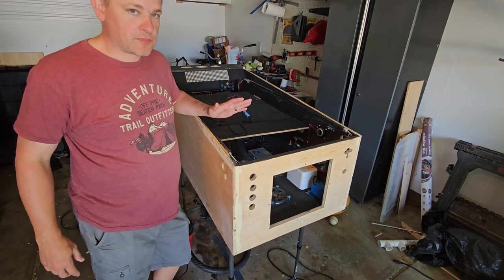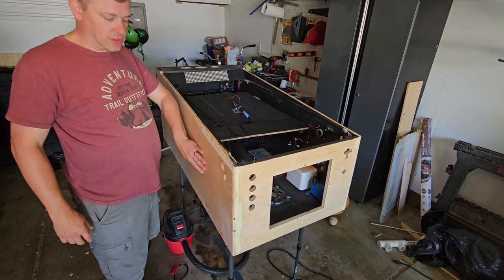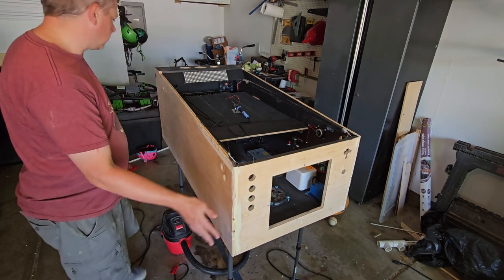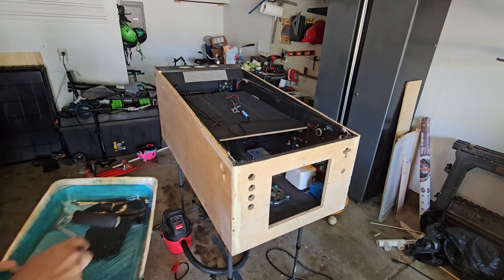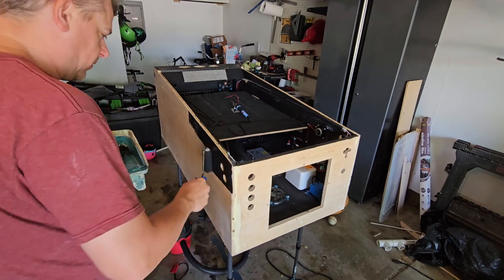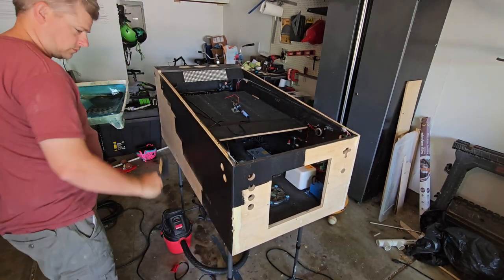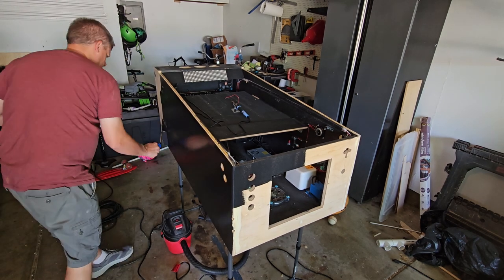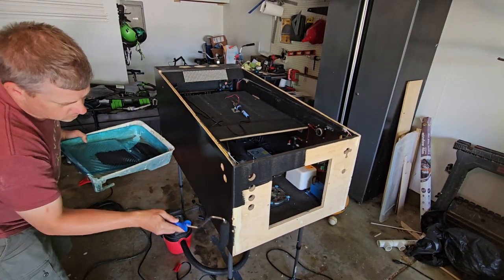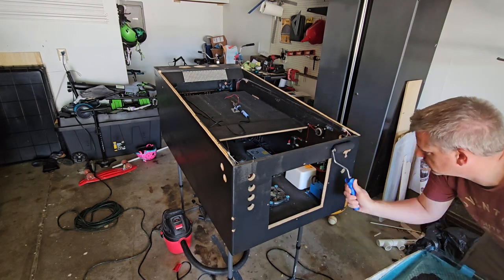It's now day five of sanding. I think we're finally ready for some paint. The reason I'm really taking my time on this is because I only have enough paint for probably one coat, which is going to be perfect because all I really want to do is fill in the pores on the wood — the artwork is going to go completely around it, locking in up top and down below. The goal behind painting is to fill in all the pores in the wood. After that, we've got to sand it down and try to get a glass-like surface for the artwork to stick to, because the artwork is going to pick up any defect that the wood has.